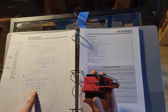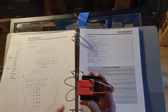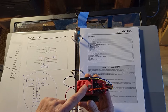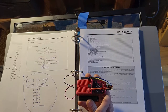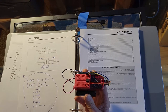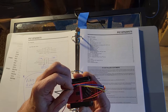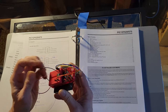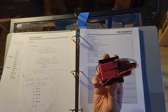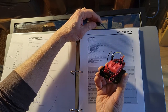The PicKit 3 has six little pinouts starting from the little white triangle, and I hook that onto my chip using wires. As you can see, there are six pins in the PicKit 3, and each one plugs into a different pin on this little tiny microcontroller. For instance, PicKit pin 1 goes to pin 4 on this chip, and pin 2 from the PicKit 3 goes to pin 1, and so on. There are actually five wires, not six — the sixth one is not used. I also plug in 5 volts from this battery pack so it will program, then plug it into the USB port going into my computer, and it's ready to program.